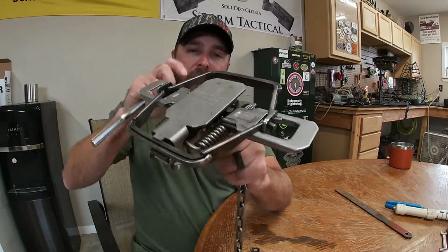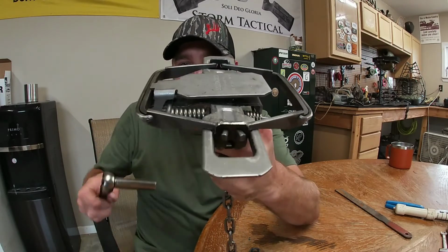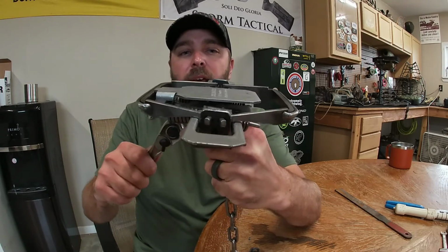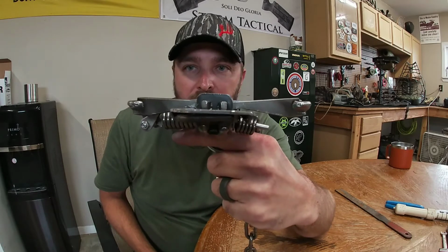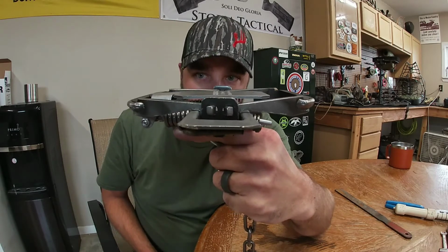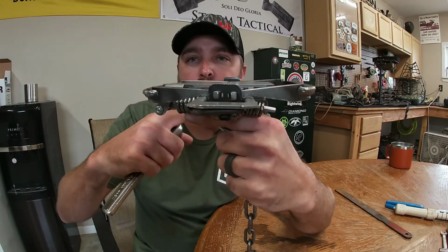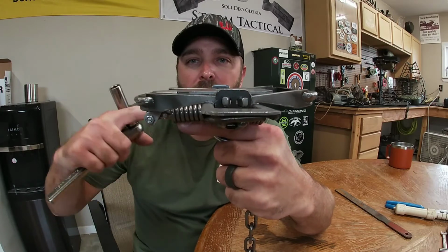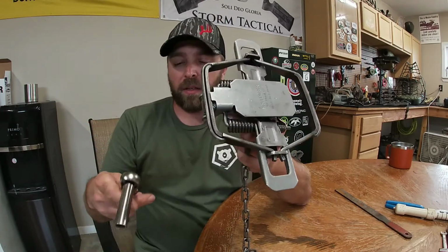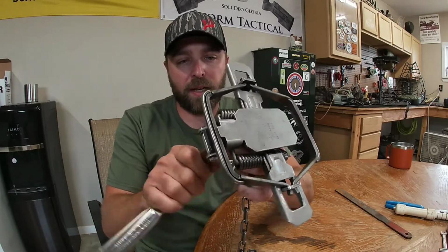Make sure your jaws are flat. And just loosening that up, brought that in just a hair, and you can just tap that back, and then you can see that pan just went absolutely level there. If it was low, you'd bring your pan that way, bring it in closer to the base. So then we'll just tighten that up, right like that.